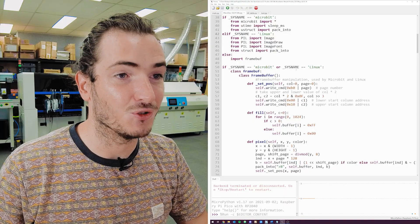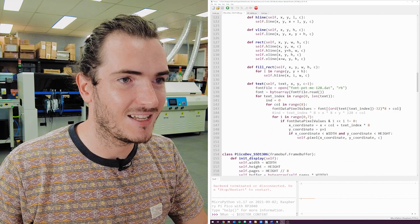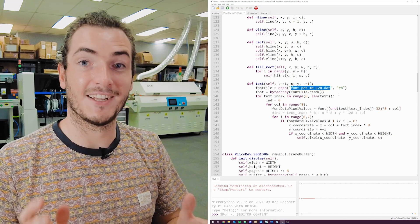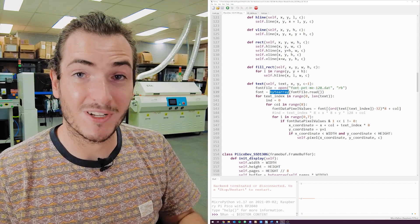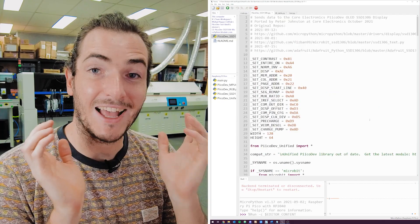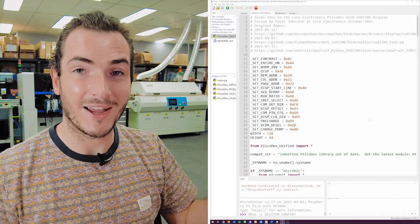If we take a look at the driver for MicroBit or Linux, we can see that the text function actually opens a data file — that data file is the font pack. We open that up, turn it into a byte array, and then when we want to print text on the display we just index down that byte array to the data that we need. Catering for all these edge cases with font and device interaction has made for quite a large driver.